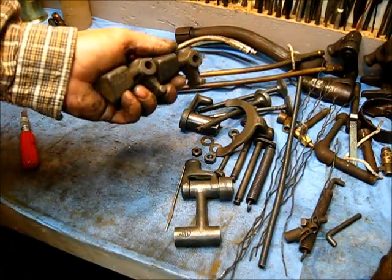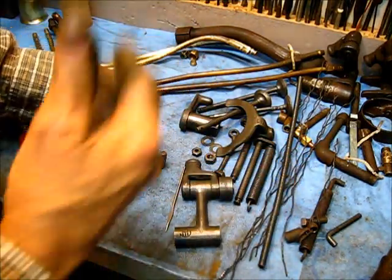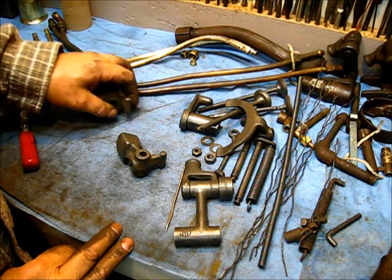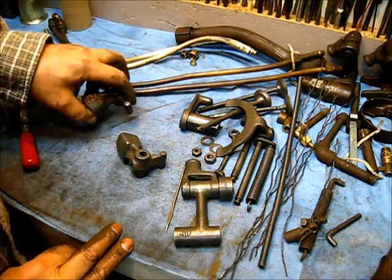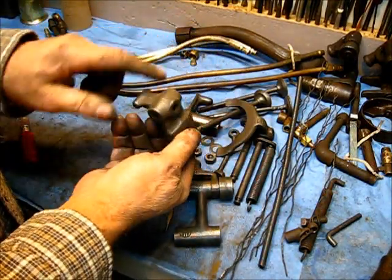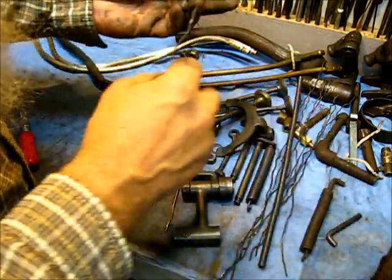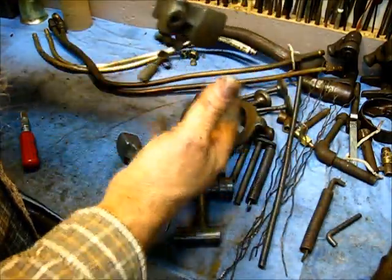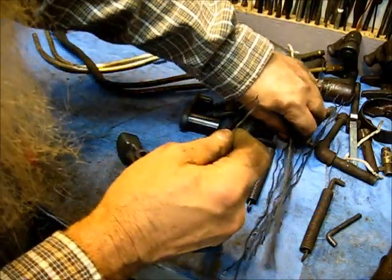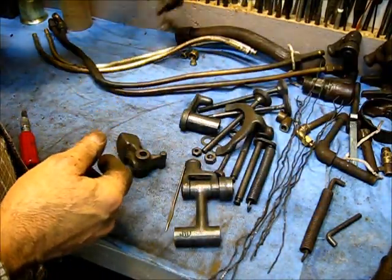These two weights right here — this weight, when I took them over to the water brush, I was talking and doing something else. This one laid out between the tank and the water brush for some time. You can see some flash rust down there because I let it dry before I water-brushed it. So this will go back in the tank — it's that easy. I mean, it's fairly clean, but it's not clean enough for me, so I'll put them back in. I'm going to load this whole thing all the way up. But that's the process.